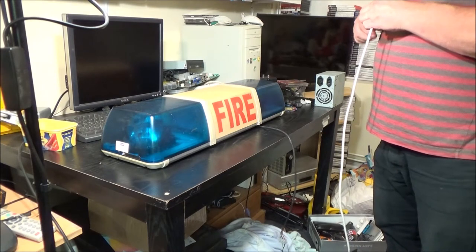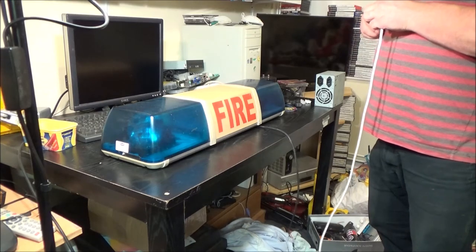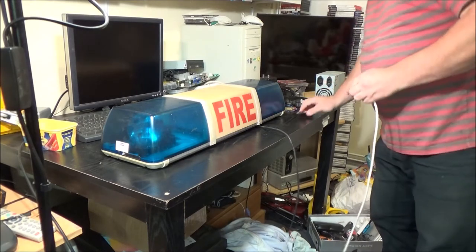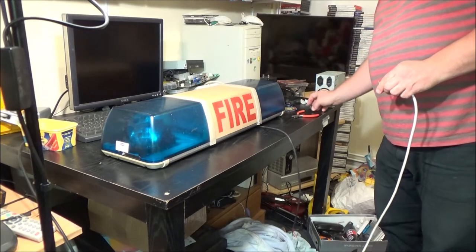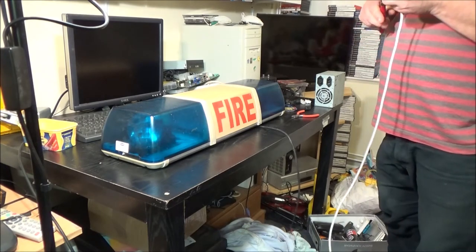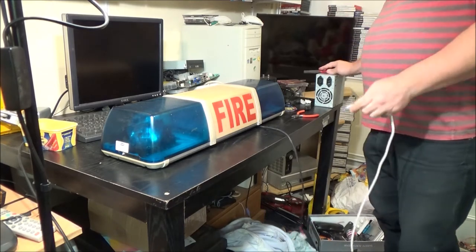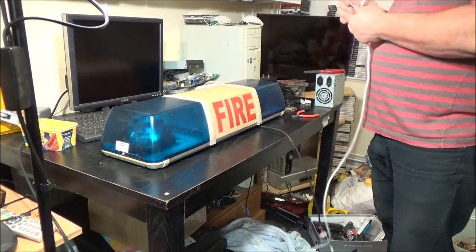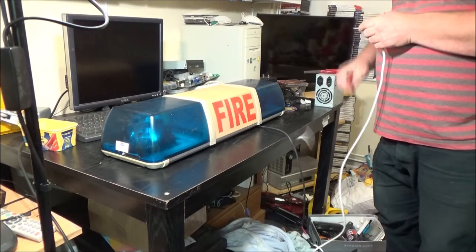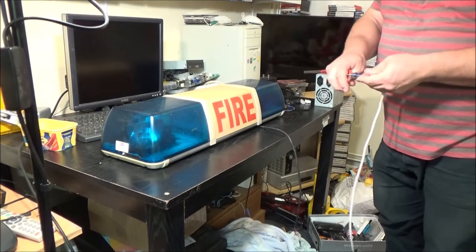And this is only going to be temporary, because I want to make a switch panel up. But I want to know if those little LEDs in there have a resistor attached to allow it to be connected straight to 12 volts. So we're going to use the trusty computer power supply here in order to find that out. Right, I have to turn you round, I think, for the moment. Or in a moment, I should say. Let's cut all these wires down to the same length.